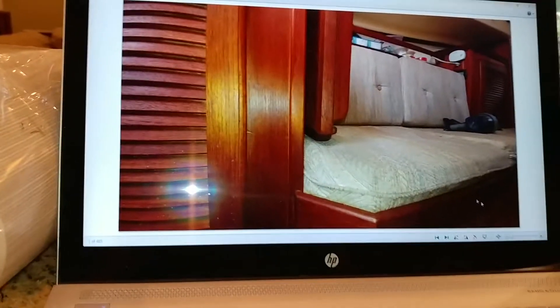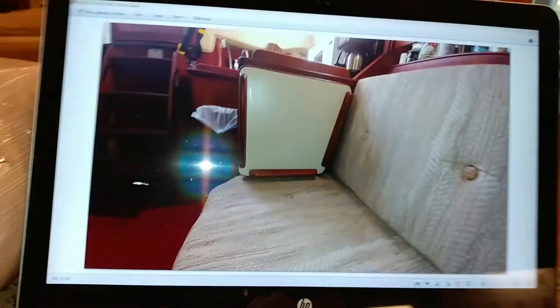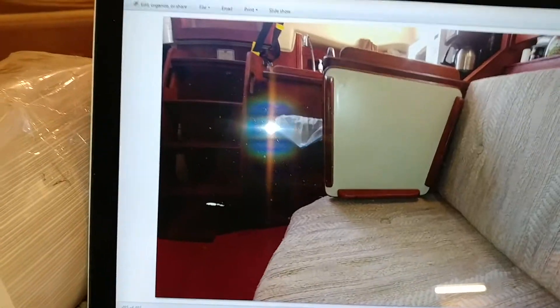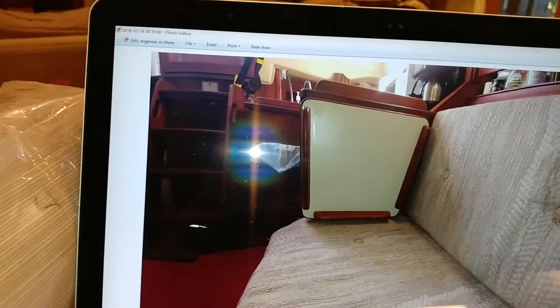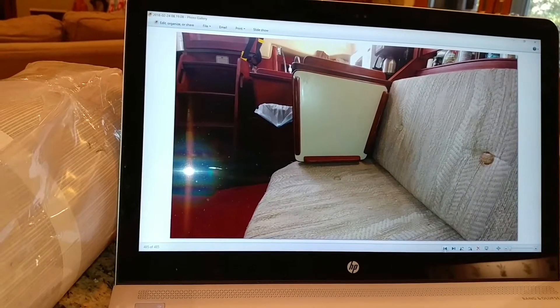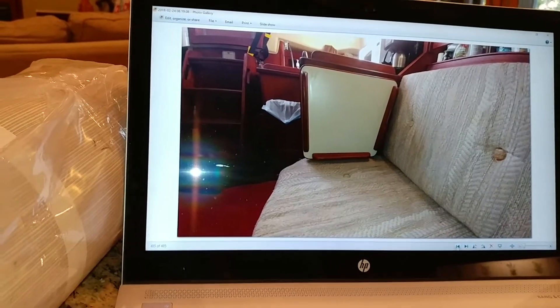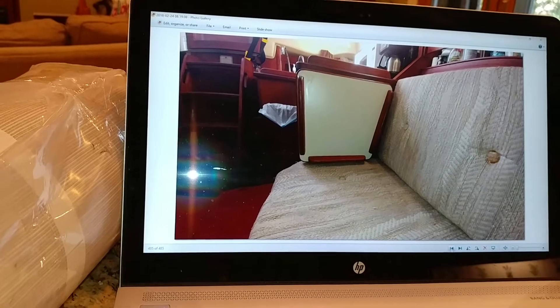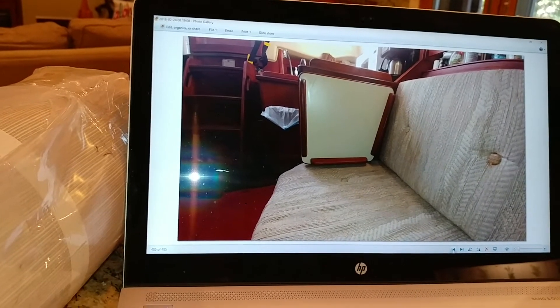Here's how it looks now — the cushions. You can see the cushions there, and you can also see this area — it just looks so much better. The teak everywhere looks so much better. I used a mixture of vinegar and water to clean, and then I used some bleach. And then I used liquid gold. I'm going to use this teak oil that somebody recommended for the head, because I'm afraid the liquid gold would come off when I take a shower or something.